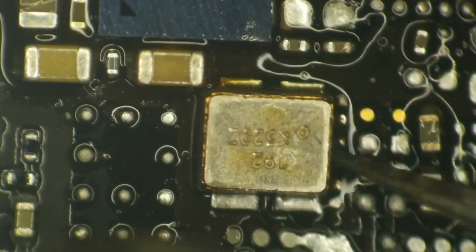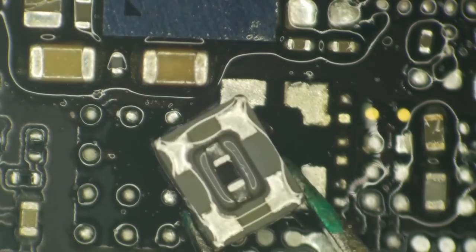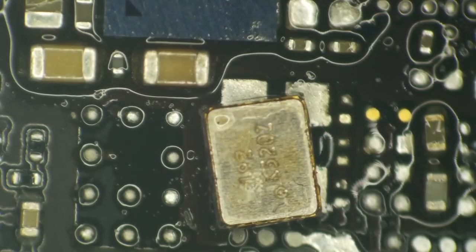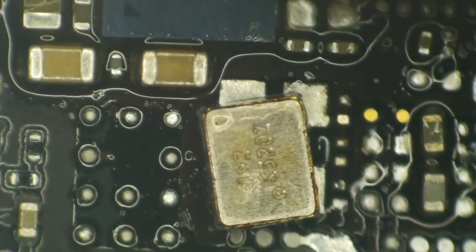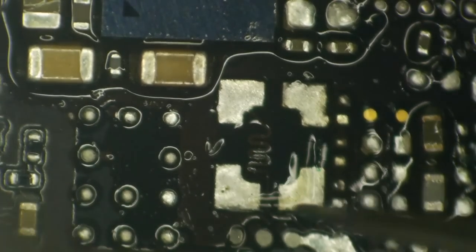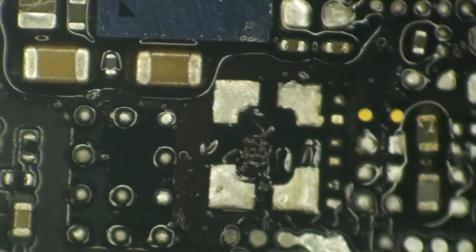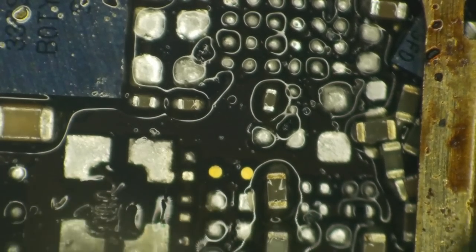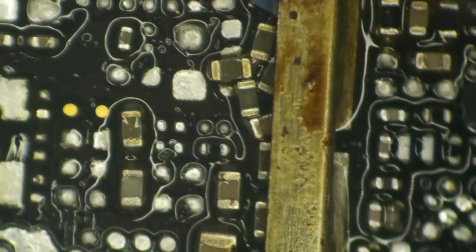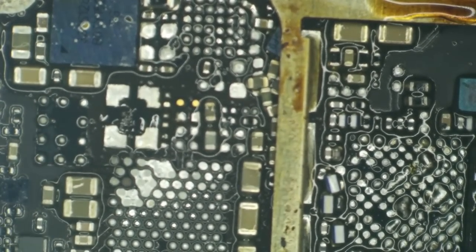Wait — this oscillator is completely rotated. That's supposed to be on the board oriented a certain way and it's clearly turned. Let me go ahead and get that out of the way. It's actually kind of cool — it's got an extended trace under it, sort of like an antenna, for some oscilloscopic reason. Now I'm going to remove this bottom shield with heat rather than cutting it, even though cutting is easier on the board.